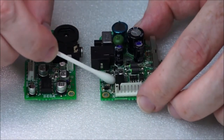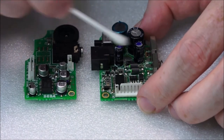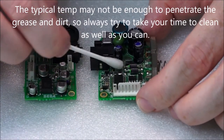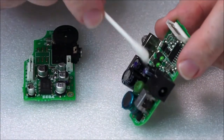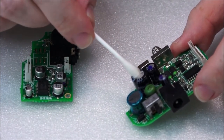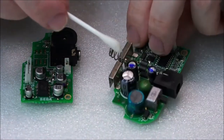This is the PCB, the power distribution board. It just means that we're not fighting through gunk when we're trying to desolder things, because the gunk can actually mean that the heat isn't hot enough. And then you have to go hotter, so you get a hotter soldering iron, or maybe you have to leave it there a little bit longer. And then you might start damaging good parts next to it. So we want to save this one. If we get too hot, trying to remove this, and there's gunk, the heat will spread to here and potentially damage the component. You just want to get the joint, the solder spot, very, very hot. Let it melt, release, and it's done.